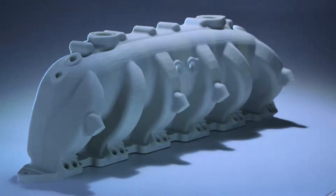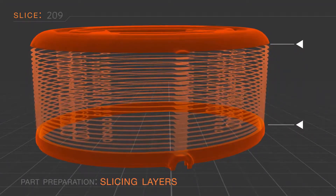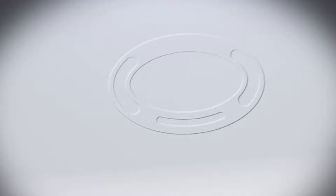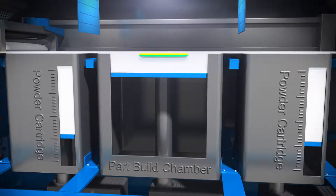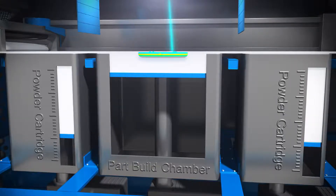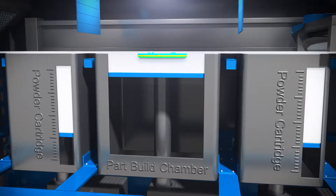It's not just a show-and-tell piece. We start with a CAD file and we integrate that CAD file to create two-dimensional slices. The entire build area is heated up to close to the melt point, and then there's a laser that actually heats where you want the solid part to be. The build platform drops down as each layer is grown and a new layer of powder is added on top, and again the laser shoots down sintering each layer to make a solid part.